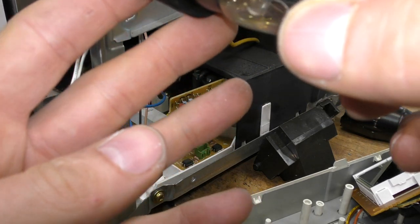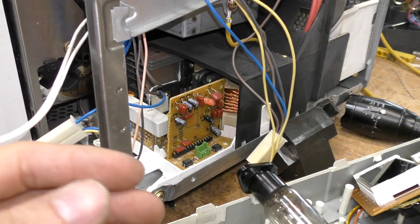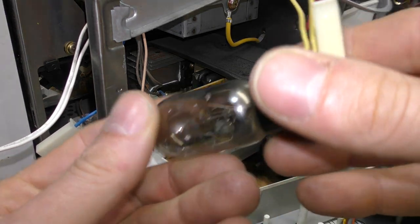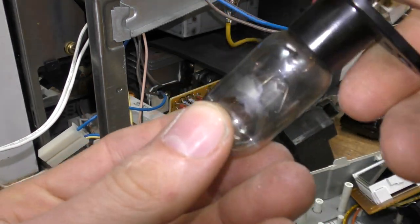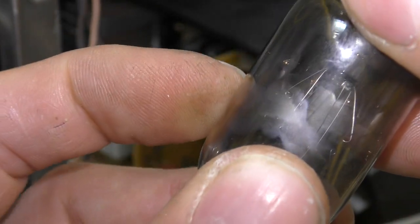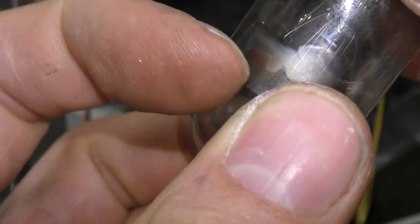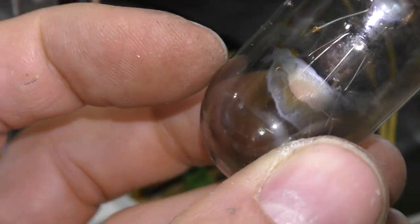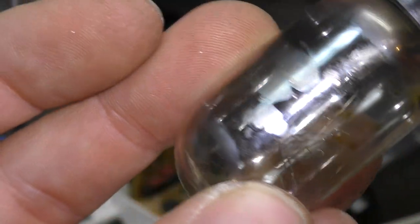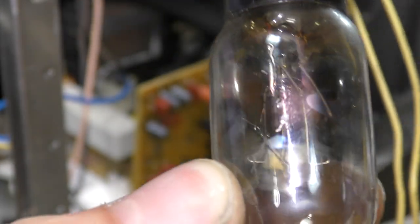It's a bit of a shame that it's now in that state, but possibly there might be some fun to be had in the future with that transformer. I thought it was just an interesting chain of events — something apparently fairly benign like a bulb blowing has effectively destroyed the thing. You can actually see little globules of molten metal deposited on the inside of the board when the PCB track vaporized. A friend said it made quite a loud bang — part of that bang was the bulb, and the other part was the vaporization of that fuse on the board. It's a fairly explosively dead bulb — quite an interesting failure mode.